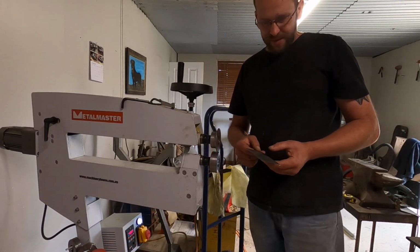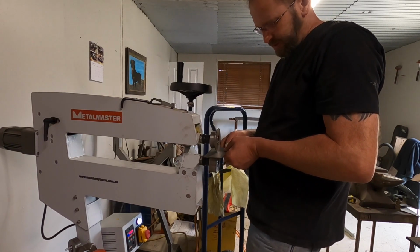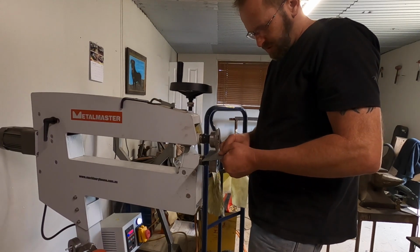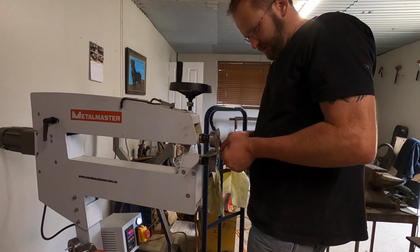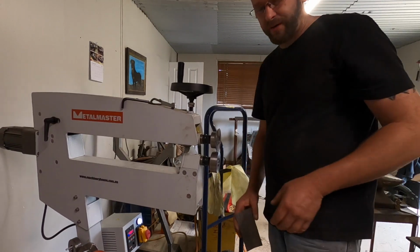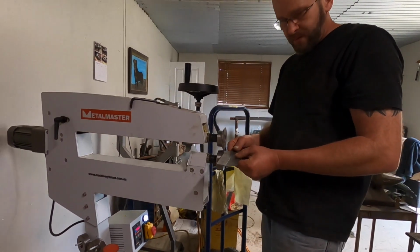Okay, here we go. First thing I'll do is use the tipping die just to give it a slight tip. So, the foot pedal, just run it along my line, like so. One more, just very slight. Run off the line. Go back. That'll do, I reckon. Now what I'm going excuse me, I inhaled too much dust. Now what I've got to do is run along that line with the tipping die so it makes a mark on the other side, because I've got to do it from the other side next time. Oh, sorry guys.